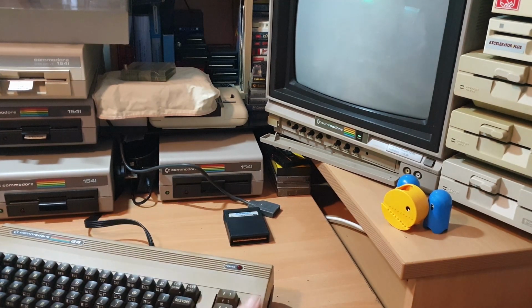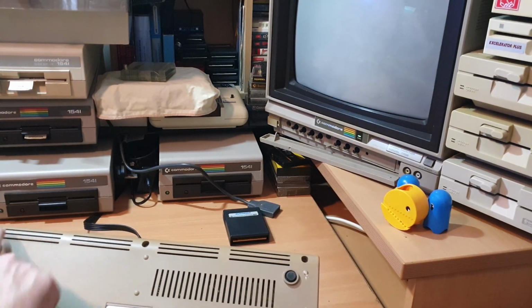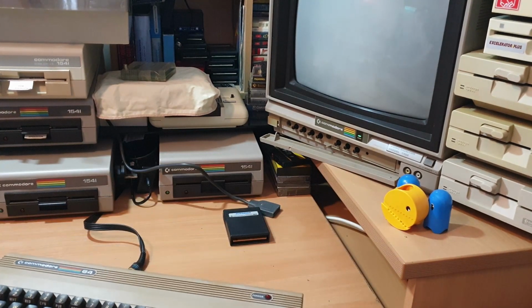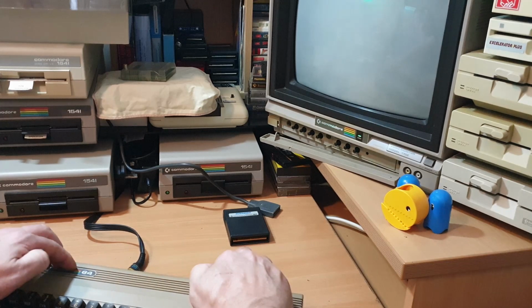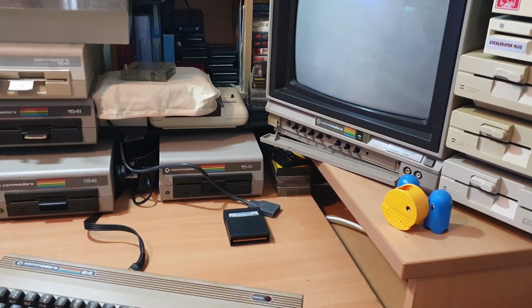The aerial. So we only have 3 screws in the bottom. One there, one there, one there. The clips on the back here are latched. Be very careful when you lift them up, because you lift the front up, tip it back carefully, and you'll hear these clips unclip and snap. If you're a bit too rough with them, they'll just shatter, break off, because all the plastic's gone quite brittle with its age.